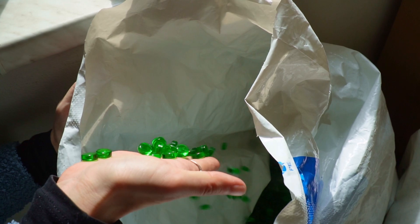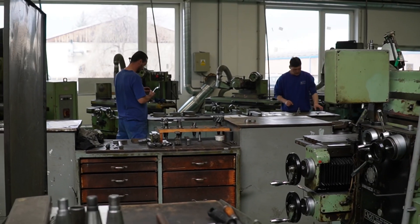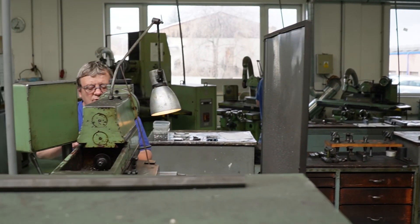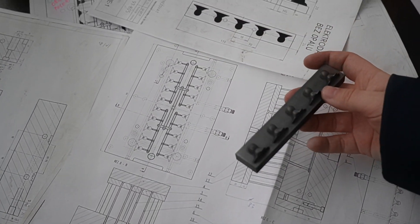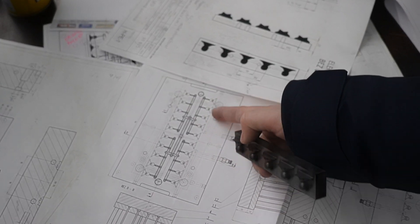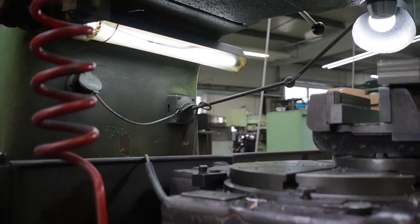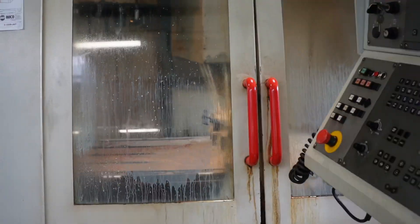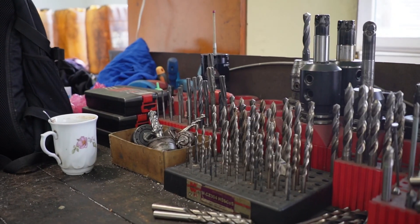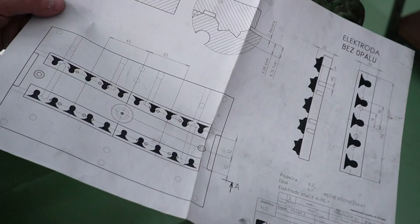And how are the molds inside the machines created, you might ask. How do you get completely different components and custom shapes? The mold is basically a hollow cavity that when you inject the plastic, it takes the shape of that cavity. The material of the mold is hard iron, and using electricity and graphite — because graphite is a material that's easier to shape — they slowly chisel the iron with the graphite and create the mold.